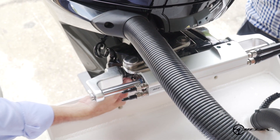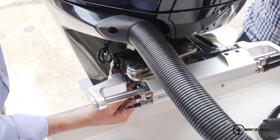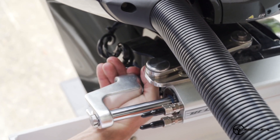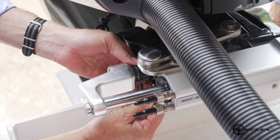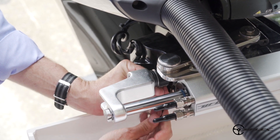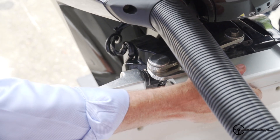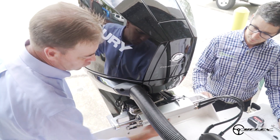The last thing to do is tighten the adjustment ferrule to take up that last little bit of slack. There's not enough space to warrant another spacer, but there's enough lost motion that I need to adjust the tensioning ferrule and get it nice and tight. Then I tighten the set screw — where it lands depends on how much space you need to consume. At that point I can confirm there's no movement in the cylinder; all the spacers are consuming the empty space between the bullhorns and the tilt tube rod, and we're ready to go.